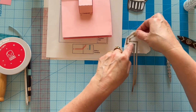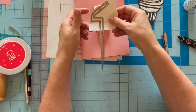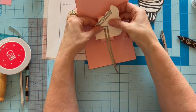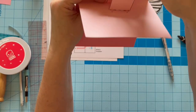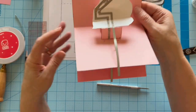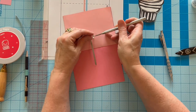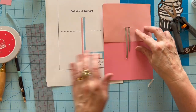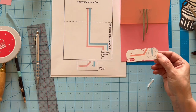This time, I'm applying rainbow fade animating LEDs. Like last time, glue down the circuit layer to the top of the flying plane supports. This time, center the conductive traces over the slot and thread them through — wait until they're through the slot to remove the protective backing. Use the circuit diagram as a guide and keep the conductive traces parallel so that the positive and negative do not touch.